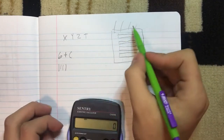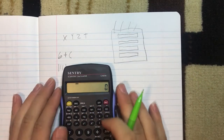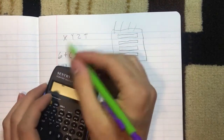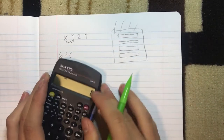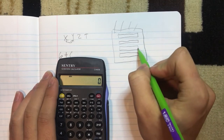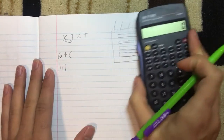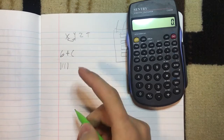I wonder if there's actually, does it use the display register as a thing? I don't know. It also has a swap button to swap the 2 registers, which is probably some sort of flip-flop that swaps the enable lines on the 2 registers. I don't know. It most certainly doesn't actually swap the contents. That would be ridiculously complex. Kind of like in the Z80.